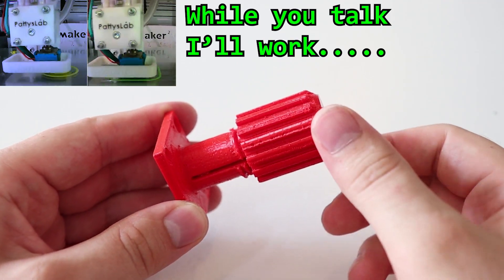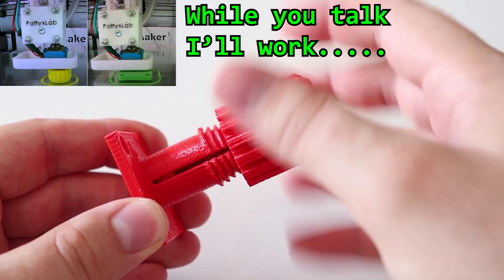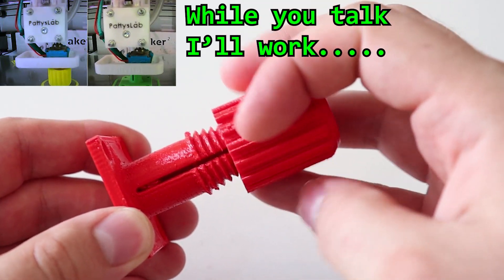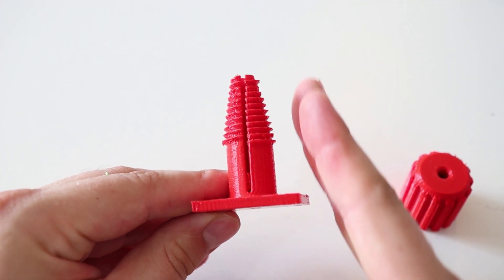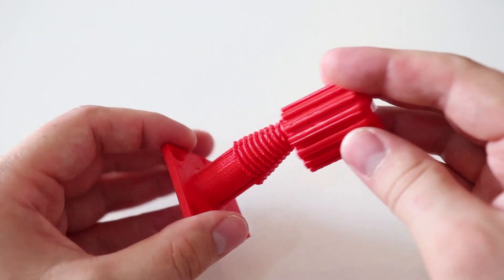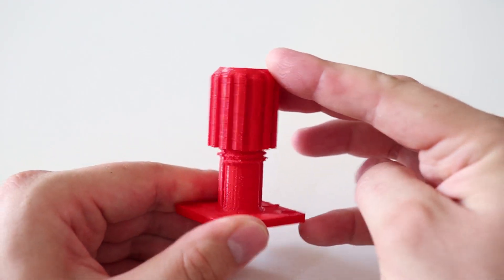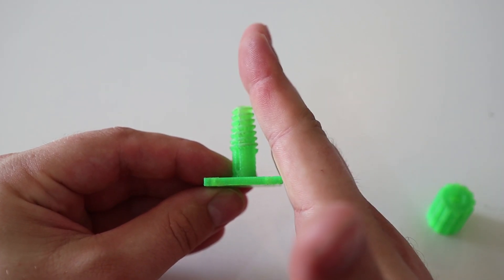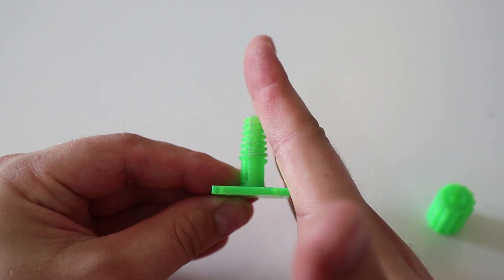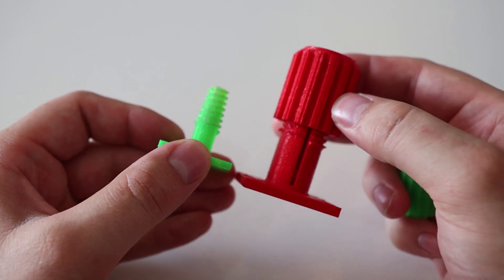I had seen this clamp-style connection about 5 years ago and I've never seen it since, so I'm really curious what you guys think about this connection method. This is version 1, and the body uses a tapered screw of 10 degrees. This made the part way too bulky, and that's why version 2 came to life with an angle of 5 degrees. With the help of this smaller angle, the body could be made smaller, which as you can see is quite substantial.